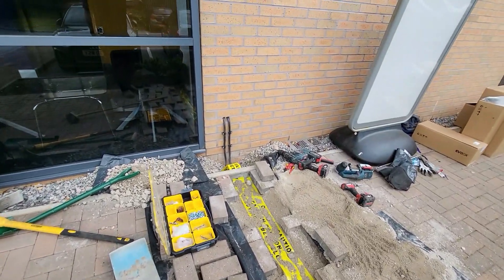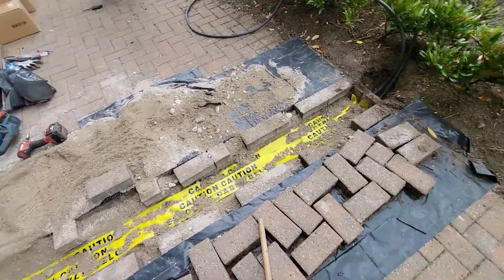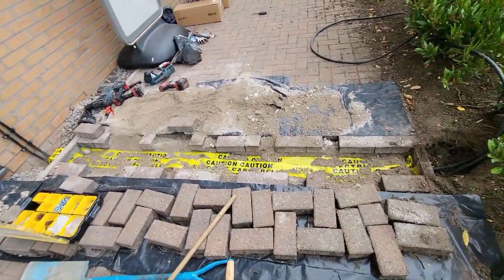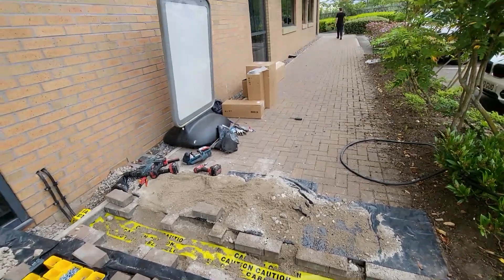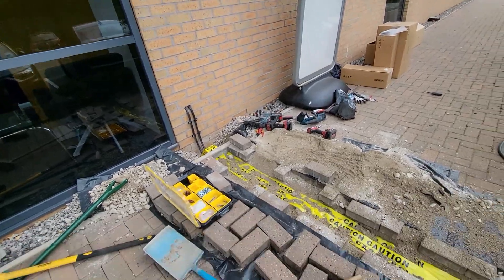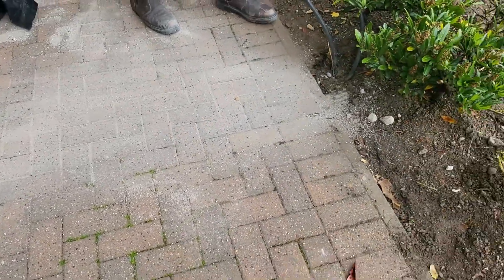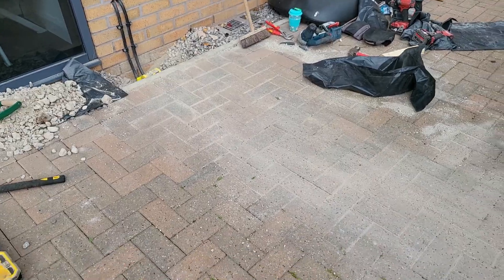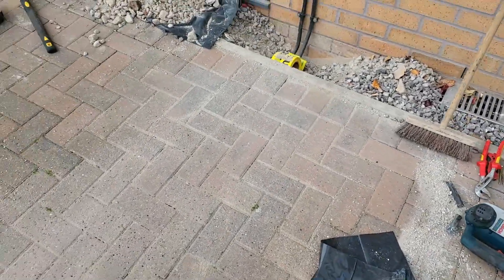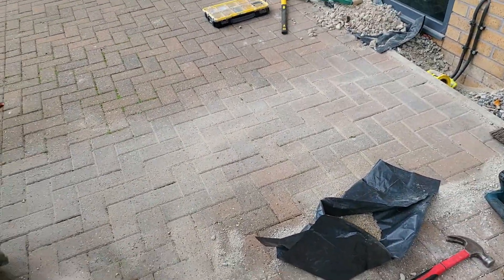You can see we've got the block paving all out now — it just lifts up and once you've loosened one block it all pops out as you need. Take the smallest width possible so you can get a shovel in and dig out to the depth required. We've used different substrates and electrical warning tape at three different depths, so anybody coming into this area for landscaping in the future will be well aware there are buried electrical services. This is the block paving put back — reverse the process, level the surface, drop them back in, get them nice and tight, then sand in the gaps. Don't forget to over-sand and reseal.